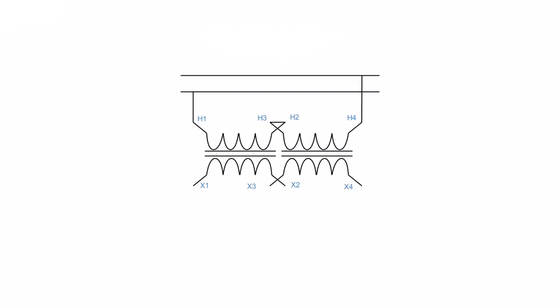So in order to make this connection, you have to have these windings connected properly. It's all about the polarity when you're dealing with a series connection, or sorry, a primary connection. If you have the wrong polarity, bad things can happen. So let's see what happens here. So we're designating a polarity. I've got my negative line, I've got my positive line, which means that current is going to be flowing through this from negative to positive, which means that current is going to flow across my windings like this. It's going to start on the negative, work my way down through these windings, loop around, and go across that winding and come out to the positive.